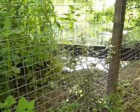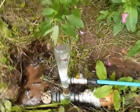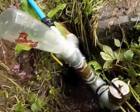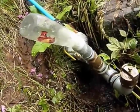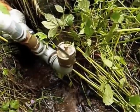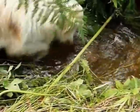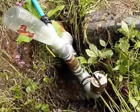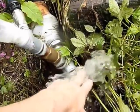That's the pond there and I've just let the cover off the pipe so we've got water down to the pump. This is my test pump. I've got a plastic bottle on the top here just to make a bit of a pressure vessel. I'm just going to run it up and test it and see if everything's working right. The pump's about six and a half feet - probably a good foot off the level of the stream. I reckon I've only got about two, two and a half foot of head, which is not ideal for a ram pump. But this is a test so we're going to see if we can move any water at all. Let's fire it up.